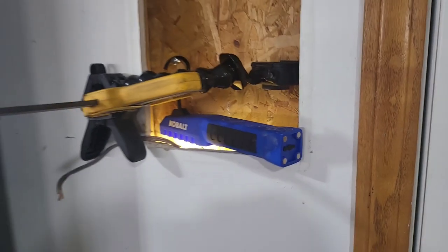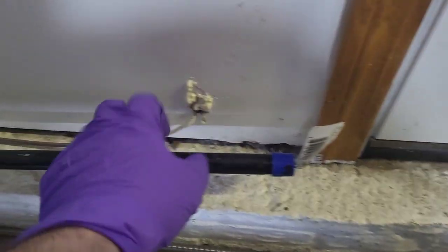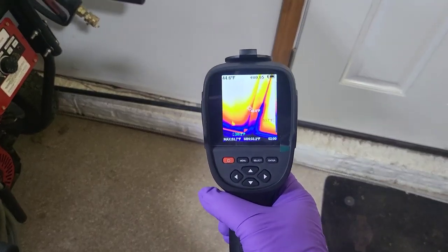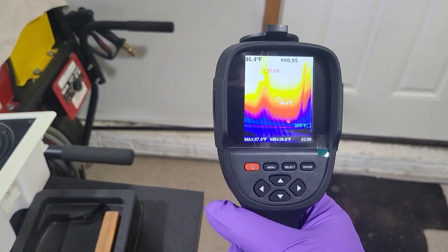One bag costs $15-16 bucks. I just started looking and look what happened. So there's this three-inch big gap — I have this hole in my exterior wall that had a speaker in it. I injected Great Stuff in the bottom, a whole can, through where the previous owner ran the cord for the surround sound speaker.